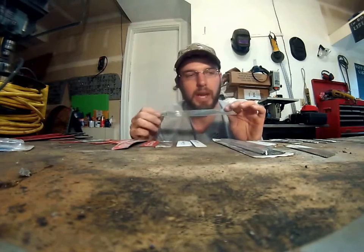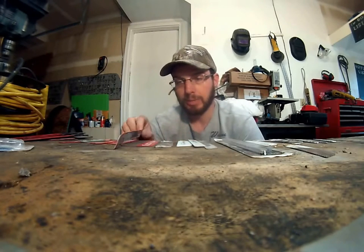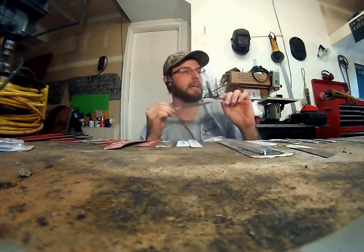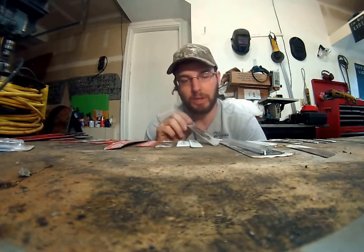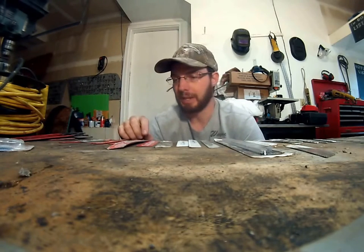What was interesting to see was where the diamond shined and where the carbide abrasive shined. They cut, but they take a long time to do it. So I would say it would be a good idea to have some of these in your toolkit. And the diamond took longer as well, but it was the only one to cut the actual hardest thing, which was the drill bit at a 66 on the Rockwell hardness scale. That was the only thing that actually managed to cut that and cut it cleaner than anything else. When is that going to be an application for you? I don't know why you need to cut a drill bit in half or some steel that hard, but at least we know it does it.